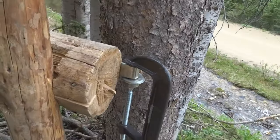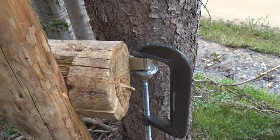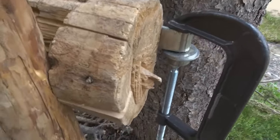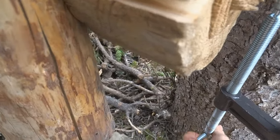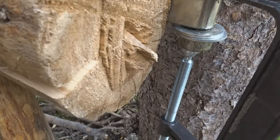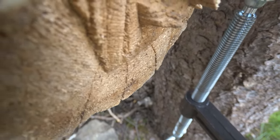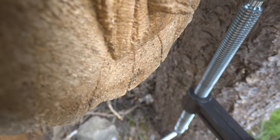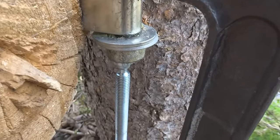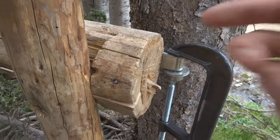To save messing around cutting washers and re-welding them, I'm going to use the brute force and ignorance method — getting a G-clamp on there and making enough turns to squeeze them together. It's a bit naughty doing this because you should really let it settle itself, but because it's not braced yet anyway, once I put the bracing on I'll probably remove the clamp. I'd show you doing this on camera but I need two hands, otherwise it keeps wanting to slip off.